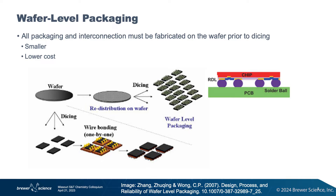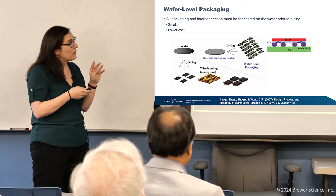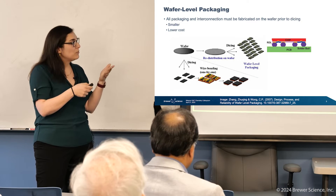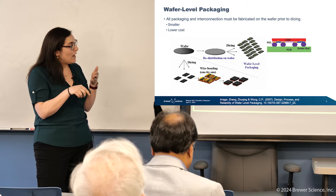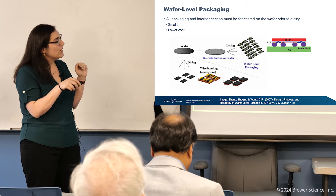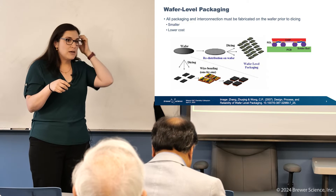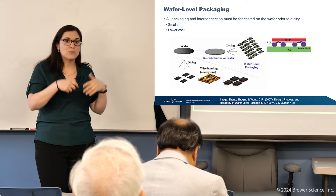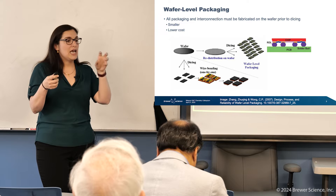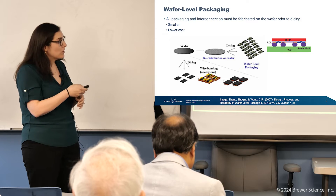You have all of your devices on this one wafer. And instead of dicing it first, what we do is we make all of those interconnections first, and then we dice up the wafer. This is called wafer level packaging, and it's a little bit more sophisticated than wire bonds where you do it one by one. You put all of your metal interconnects down first before you do the dicing, which helps with throughput efficiency. As we get to more complicated devices and need smaller interconnects that aren't like physical wires, this becomes much more beneficial.